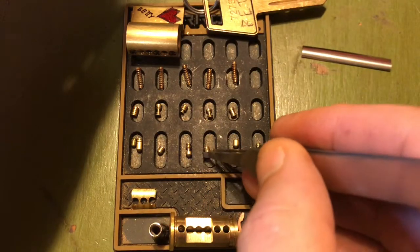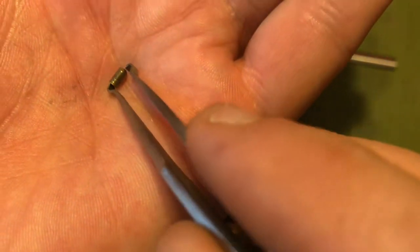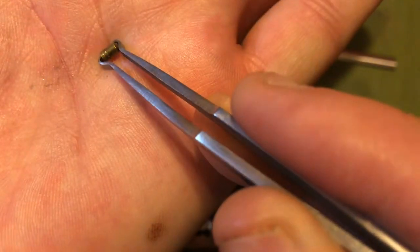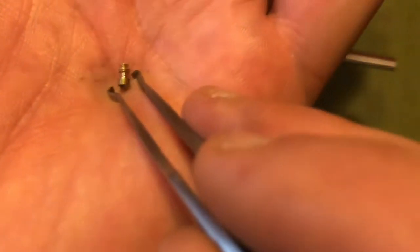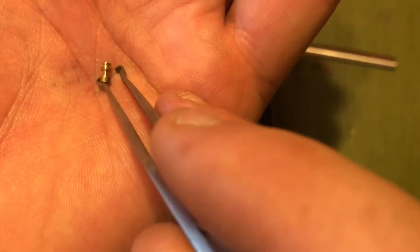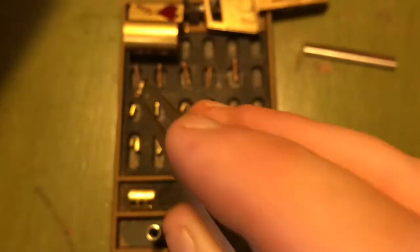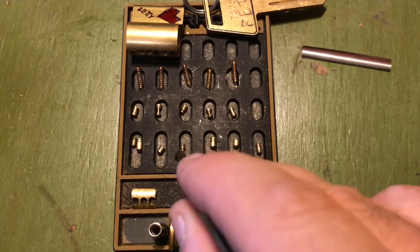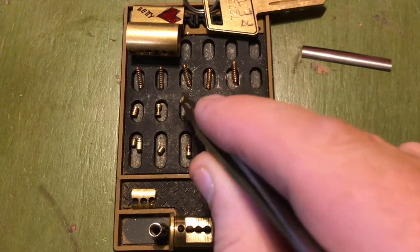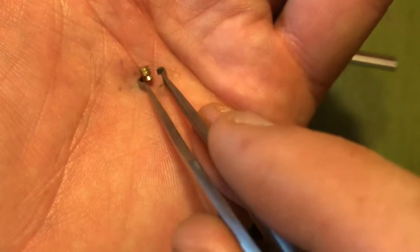It's a really nice little pin work. There's our four key pin - very lightly serrated. And our three driver - you can see he was thinking of the three driver getting up in that gap between the core and the sheath. I did have an overset on three at one point - I think it was during the first real attempt on it. And there's our driver.